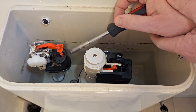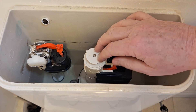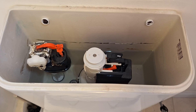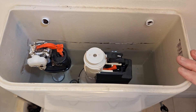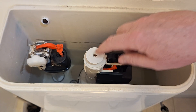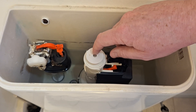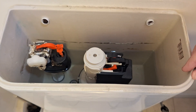When the water level gets higher, this whole float will be covered in water, which in turn causes an overflow on the outlet valve — creating the small waterfall you get in your toilet. If it's left too long, eventually this leaks more and more and all the water comes down through this. So then you get an overflow and water dribbling in.